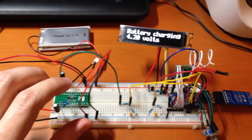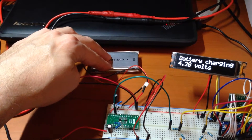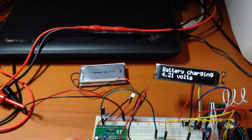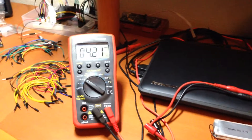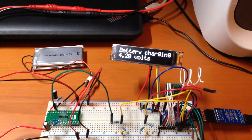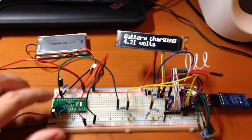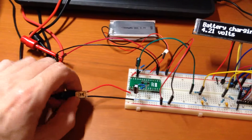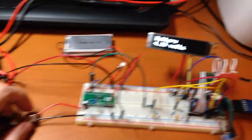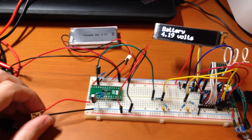This will just stay up for right now. I've got the multimeter hooked up measuring the battery voltage, and this is also measuring the battery voltage — they're pretty close. This is 4.21 and this one's jumping around a bit, so pretty accurate. I've got the USB cable plugged into the charger and it shows up as charging, and if I unplug it, it doesn't say it's charging anymore. That's working really nicely.